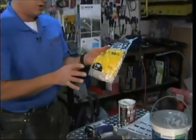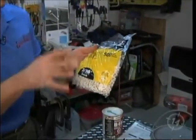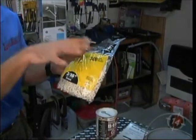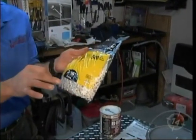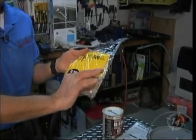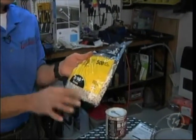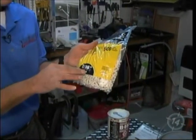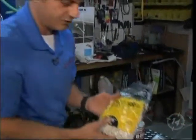We've got to worry about gravity — everything wants to settle. In this case, I'm going to use three-sixteenths spacers right on top of the backsplash of the countertop. You want that nice gap and fill it with clear silicone. You don't want your tile — in case of flexibility or the wall shifting — resting on top of a solid surface like a countertop.